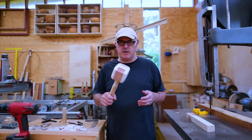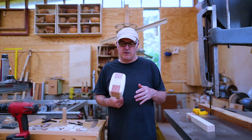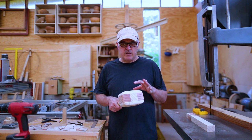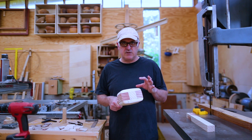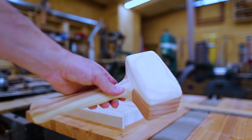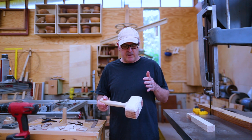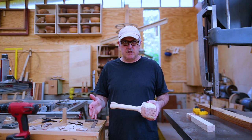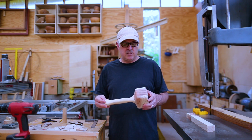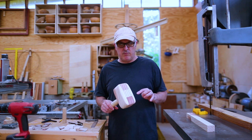Now I have a prototype made, and it's not so much about the object itself — it's the process of getting there that I needed to go through. There were a lot of steps: gluing it up, modeling what I wanted on the computer, converting that into something the fourth axis could use, and getting the fourth axis to do it correctly. It all went smoothly. This one would be nicer with a longer handle and a smaller head — it's a little cartoony. And sequoia isn't really good mallet material, so it'd be nice to use hardwood.